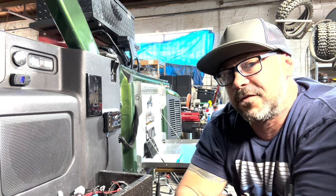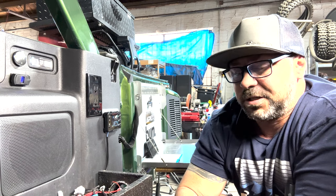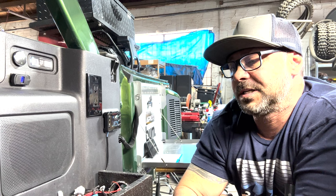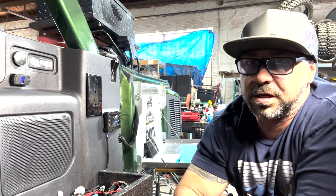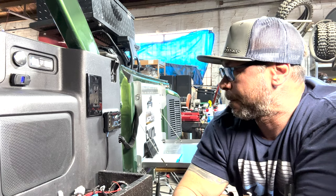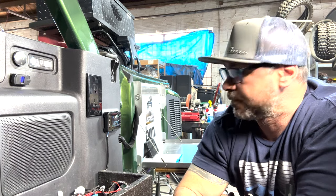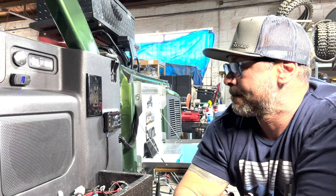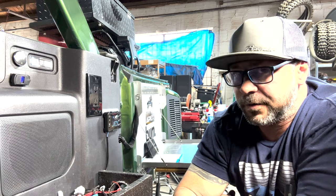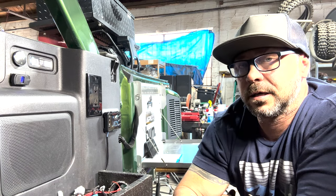Again, the first time you do it, you just don't pressure it, right? Just let it start the system, because it's the first time you've ever touched it, so it needs to prime itself. It needs to start operating properly, because that's just a good practice for how you're going to use it for the rest of its life. So right now, we're just waiting for it to fire up. And you can hear that the fuel pump is starting to get faster. Click, click, click, click.